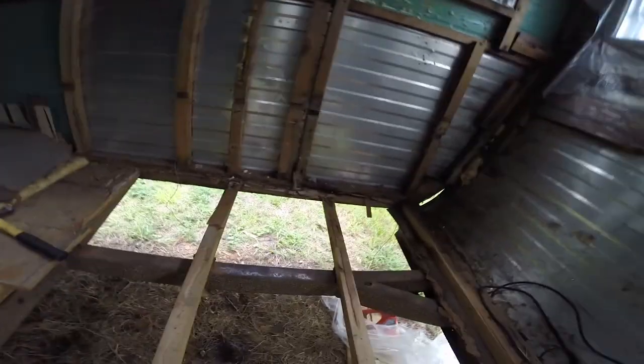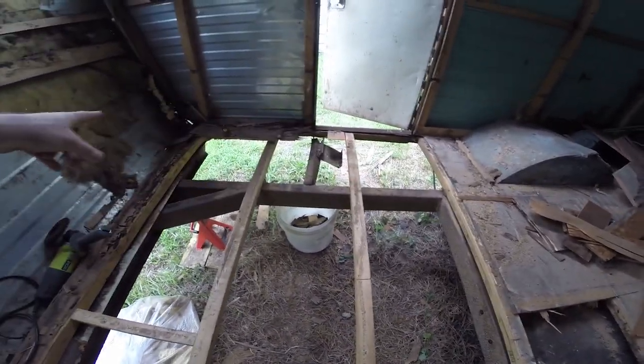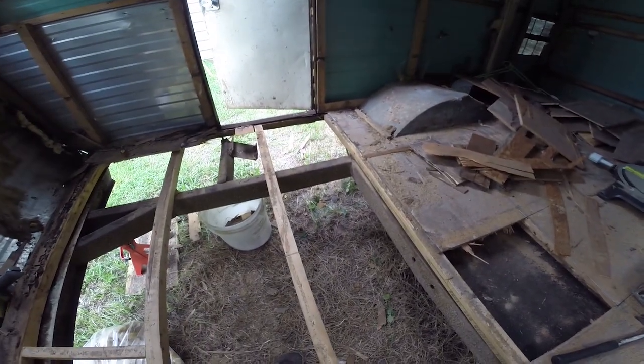This is completely coming undone by where the door is. And it gets worse as it goes. So I'm afraid what that means is a lot of the weight is being held up by this bottom 2x2. And these in the middle are solid. Honestly, these could probably not even be replaced. These are all not exposed to water at all. But the problem is they're screwed into the outside, and that's what's supporting the entire frame, with the exception of a few points like this that go through the 2x2. So what I'm afraid of now is that this side, that 2x2 is not in good shape at all.